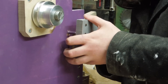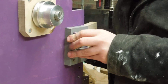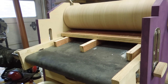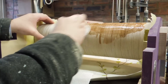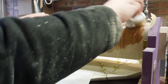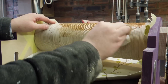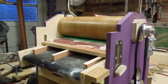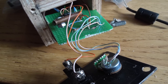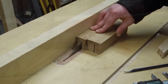The drum wasn't entirely flat, so in preparation for sanding it through I lowered the pivot flanges. The drum was then sanded flat, and after that it was varnished. I'm going to be using some spray adhesive to help hold the sandpaper on — I'm hoping the varnish makes it easier to remove than if it was bare wood. Once the varnish was dry I then sanded it smooth with fine sandpaper. Whilst waiting for the varnish to dry I'd made a box to house the electronics, and also a piece for attaching the conveyor belt motor.